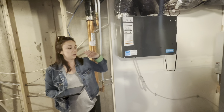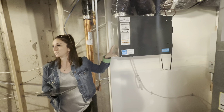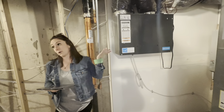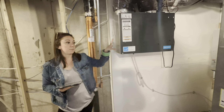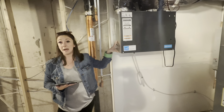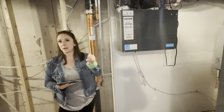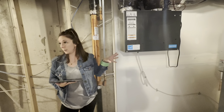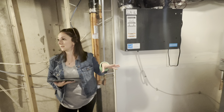Your HRV is a really good tool to help your natural services in the house for humidity levels. If you have hardwood upstairs, this will help you maintain the gaps in the flooring. If it's very dry outside, you're going to get more gaps because your hardwood is going to shrink, and if it's very humid and hot it's going to expand — and the expanding is really when we get the damage.